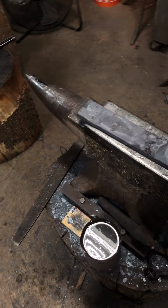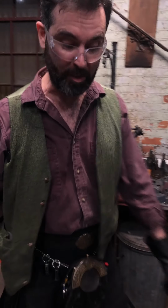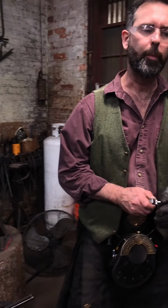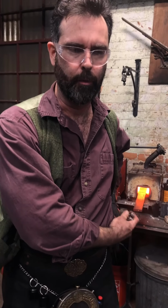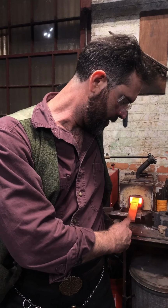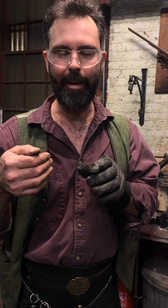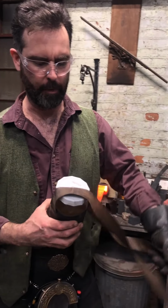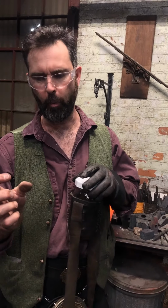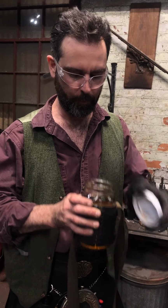Alright, so that's prepped out, laid out a little bit vaguely. Let's get it off. See if I can split it through. This kind of tool will detemper super fast because you're just jamming it through a big piece of metal and it's all being encompassed all the way around. I would recommend always making your slit slightly longer than your tool so you don't get bound up in there. Maybe 10%, 15%. So if you have a 1 inch wide tool, go to like 1 1/4 inch, something like that. It gives you a 25% addition.